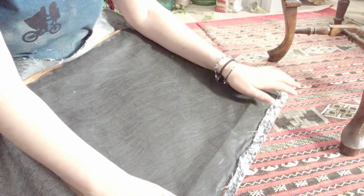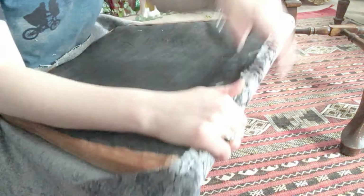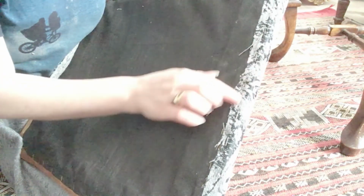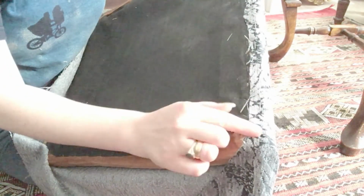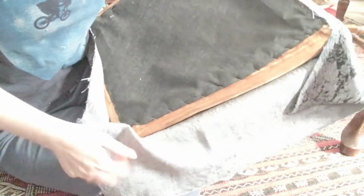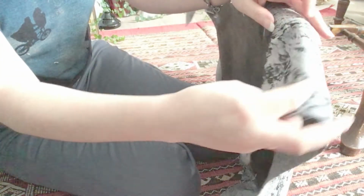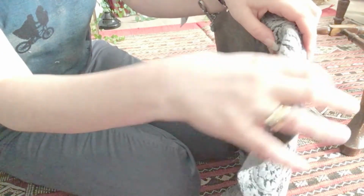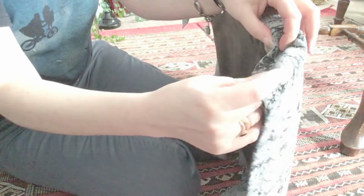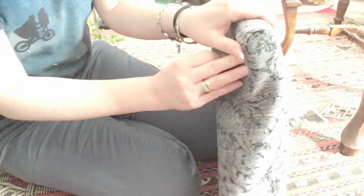I've decided to do the front corners slightly differently because this is quite a thick fabric and it was bunching too much at the corners. So you can see I've put a sort of row of the staples in around this side, and I've put one on each corner facing sort of front really. So rather across the back, which I did here on the back ones, which have got the funny little bits. These ones I'm doing slightly differently because these are the ones that face at the front, so I want them to look really smart on the chair. So I think what I'm going to do, and you can see I've trimmed back some of the fabric. I will trim some more, but I just want to make sure I get it perfect. It's all that, you know, measure twice, cut once stuff. Make sure that you're good, but it's this corner here that I'm trying to make really, really neat.